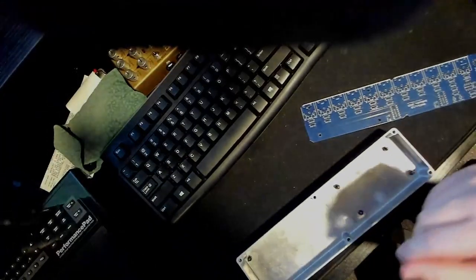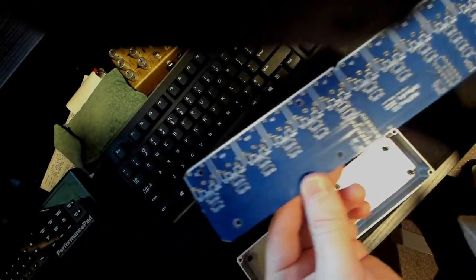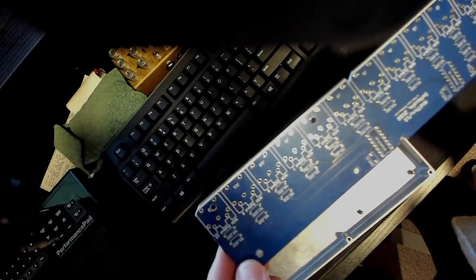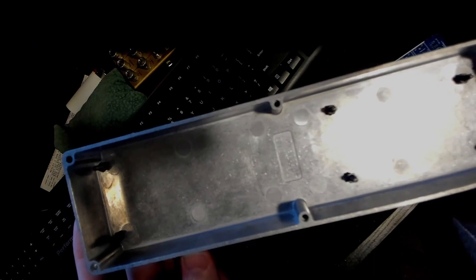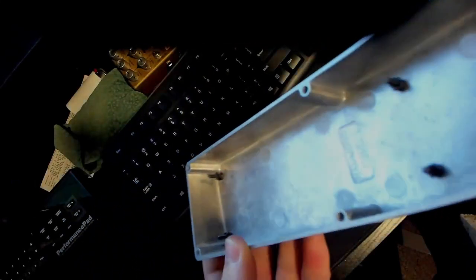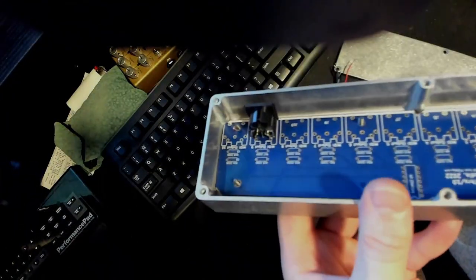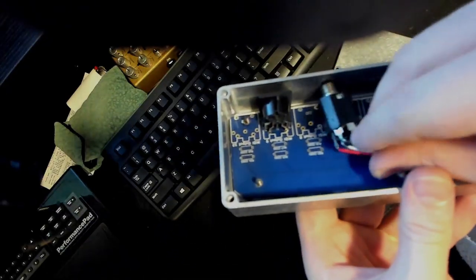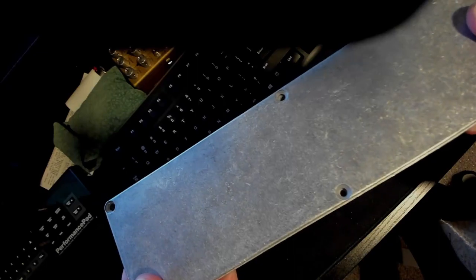Skipping over maybe 20 or 30 minutes of drilling and cutting — basically I cut away a little bit more material with the shears, made some dots where I knew there weren't going to be traces, drilled small pilot holes, then holes large enough for M6 nuts and bolts to use as standoffs to hold the PCB in place. I set the PCB down in the enclosure, made pilot dents with the drill bit in all six places, removed the PCB, drilled it out the rest of the way, and put in M6 screws with bolts as standoffs for a nice low profile. We've got enough clearance to solder components without them shorting out, and with our chunkiest sockets installed it looks like we can put the lid on without anything getting in the way.